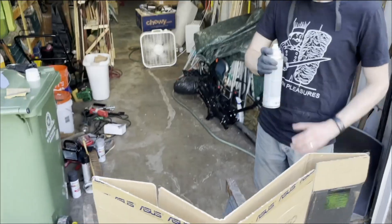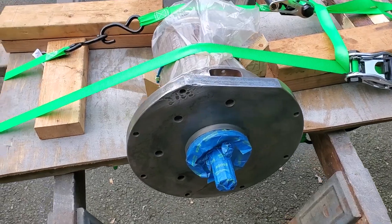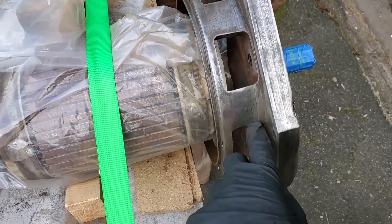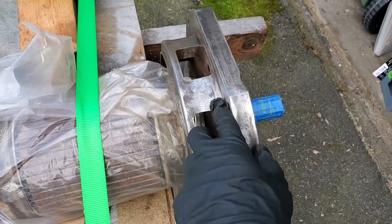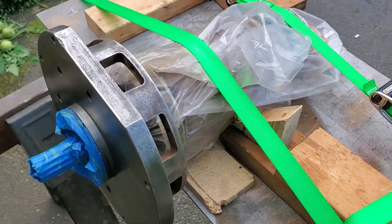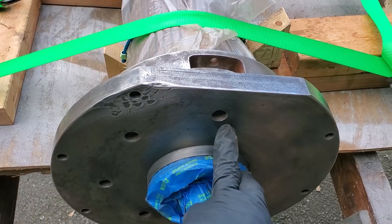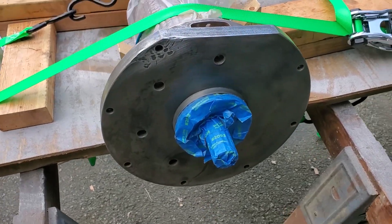Very well-practiced motion. If I get behind the cardboard, you can't see what I'm doing. Getting ready to paint the last piece of the motor housing here. The flange wouldn't come off the shaft, so we kind of had to make do. We masked off armature parts and bits that you don't want rust, dust, or paint on. You're going to have to mask off all these holes too, so we don't get paint in the threads.